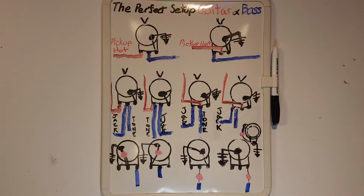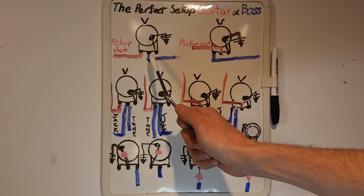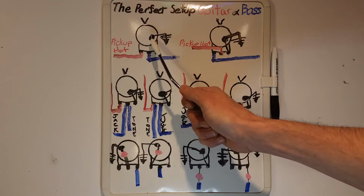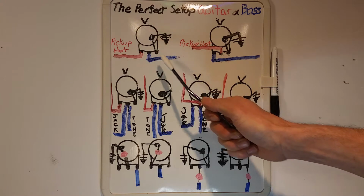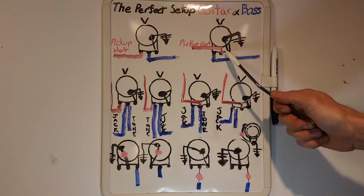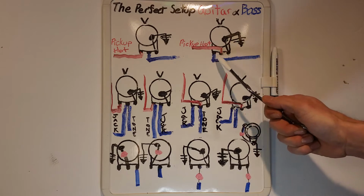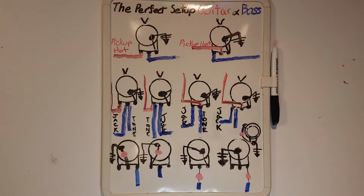Some manufacturers will have an independent slave volume with a dependent master volume. The jack's hot is being sent to the ground. This closes the jack's circuit, keeping it separate. With an independent volume, the jack's hot is free to pick up interference if the volume is turned off with an unclosed circuit. There are four ways to wire a volume with a tone.